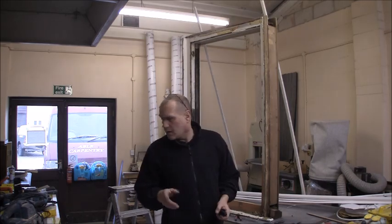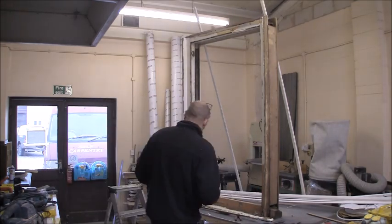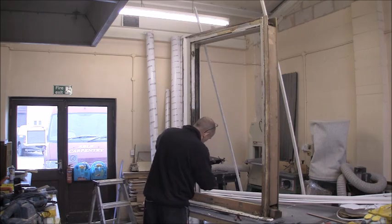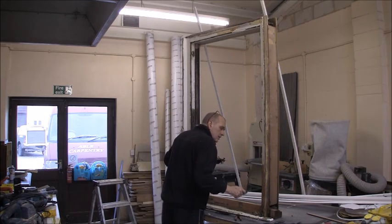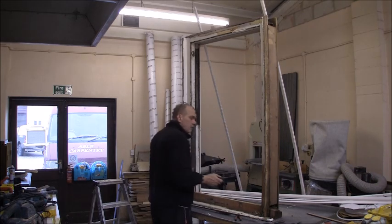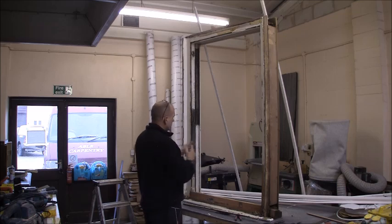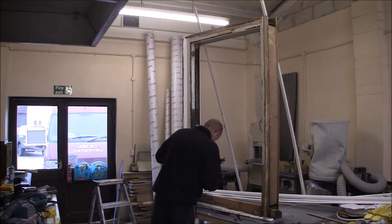So what I'm going to do, I am going to use a lever, again, a chisel, and I'm going to open the pockets, which are these pieces of timber in here. Now most of the time, they're held in with a sort of an overlap lap joint at the bottom and a triangular section that pushes in at the top. So if you lever at the top, it's a waste of time. All you're going to do is break timber and split stuff. If you leave it at the bottom, it should slide down.